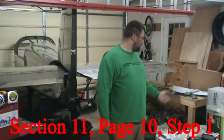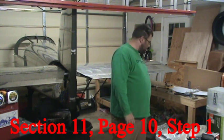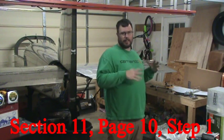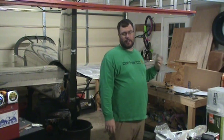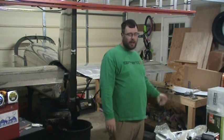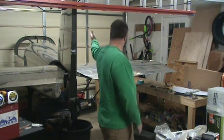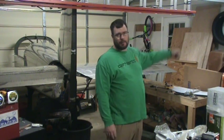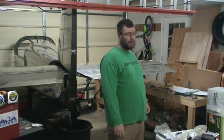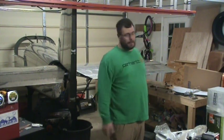Okay, I need to go find a battery so I can run this to the retract position. Right now it seems to be somewhere in the middle. And you do that by connecting to the gray and the white wire with a 9-volt battery. You can wire up the rocker switch and everything like that, but I'm missing about half an aircraft. And the switch would be up there somewhere on the control panel or on my stick, which I haven't bought yet.